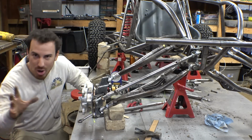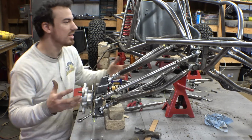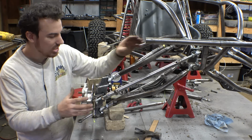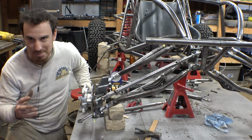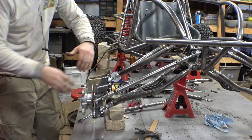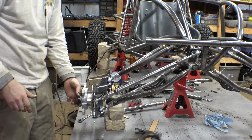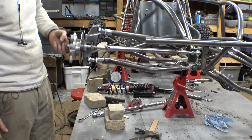Now, before I do anything drastic and just build it and hope that there's no bump steer, I wanted to mock it up first just to play around with it and adjust it, and see is there any bump steer and can I get rid of it. And I'll admit there was a good amount of bump steer, but I've been playing around with it for the last 25 minutes, adjusting the position of this and that and the length of it and everything, and it's mostly gone.